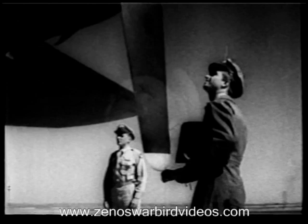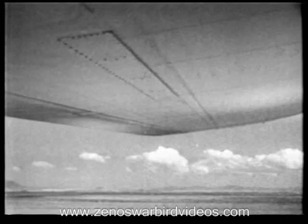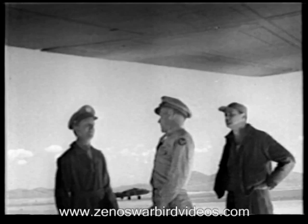Okay for number 1. Check your de-icer boot on this side. And on your way back under the wing, see that all access doors and inspection doors are snug down. The fabric on the aileron's worth checking. They sometimes put an external lock on these controls, don't they? Yeah, you want to watch out for that, especially at strange fields.